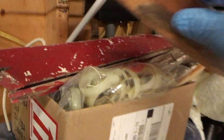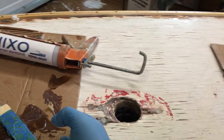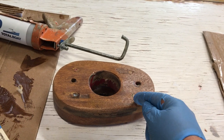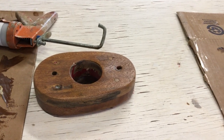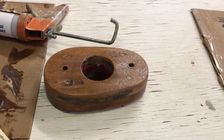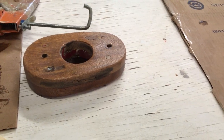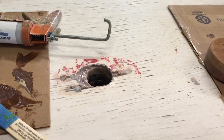On the top they have a little collar that goes around it to provide a little support and make it look a little nicer, so that'll go on there like that. There are supposed to be four screws holding it — about two-and-a-half to three inch number 12 silicon bronze screws, which is what we've used in the past. You can see the screw holes there — two there, two there. Someone couldn't find screws and had lag bolts handy, so that's where those holes appeared. We're going to seal those up and go back with the factory screws. There you go — now run out and take care of your mast step. You're welcome.